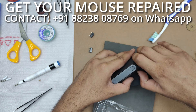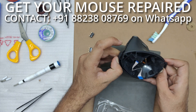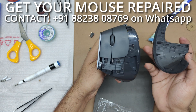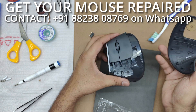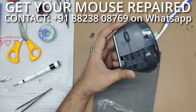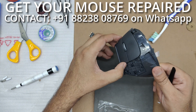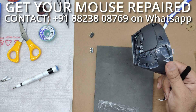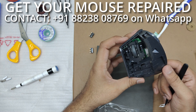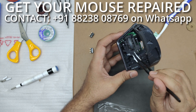It's very hard to grip, especially if you have small nails. And finally we were able to get this plastic piece off. Now we are faced with a total of four screws that we will need to take off. Now we have access to the scroll wheel, scroll encoder, and the scroll wheel assembly.